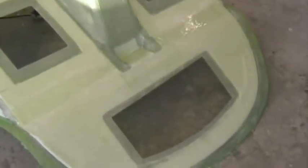Seat module has been roughened all the way around on the bond areas, including where it contacts the top of the carry-through spar and the rear bulkhead. Here all the cotton flock is on, ready for bonding. That's the sort of size mound of cotton flock I've used. I've used slow hardener. There it is on the carry-through spar, on the rear bulkhead, on the brake master cylinder bracket, and of course on that front bulkhead. You can see it there. I've smeared a thin layer on all the bond areas of the seat module as well. In total I've used about 400 grams.